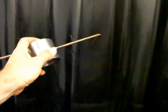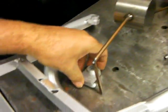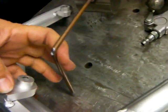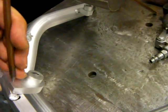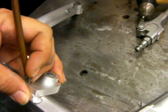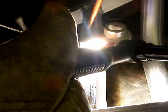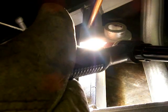I'm going to try to put a nice heavy bead on that. A third-hand tool — you can make them out of anything, a big piece of bar stock and some pieces of round stock bent over and sharpened on the end. I'm holding the camera with one hand and showing you it's pretty easy to use. It's really great for holding odd-shaped things in place while you get some tack welds on them. I put a little pressure on it, get it lined up, and put some tack welds on it.